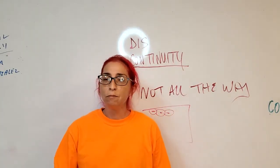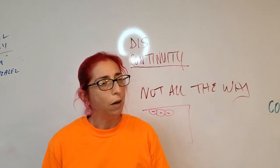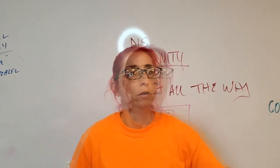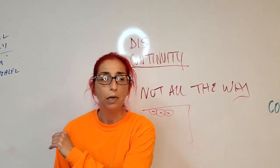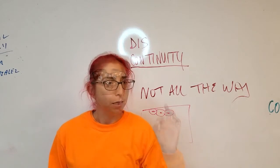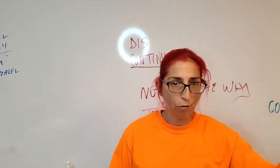Why do people get slag inclusions? You're not getting the slag completely off, right? Think about that. I want you to think a little step further. Why could they not get the slag off? Possibly, it could be, but here's the thing. Poor bead placement. Last week we talked about bead placement and making sure that we put everything in there correctly.